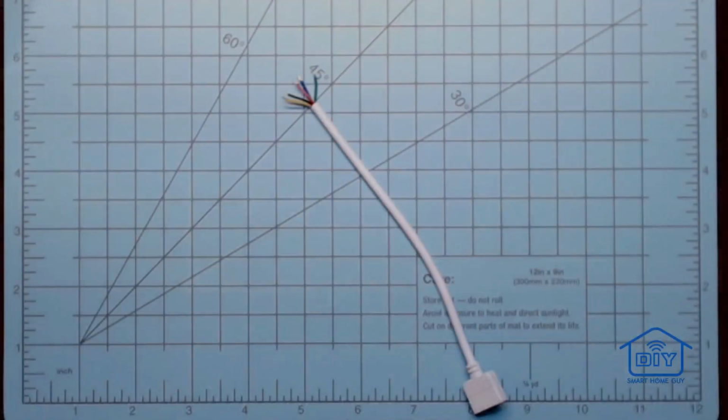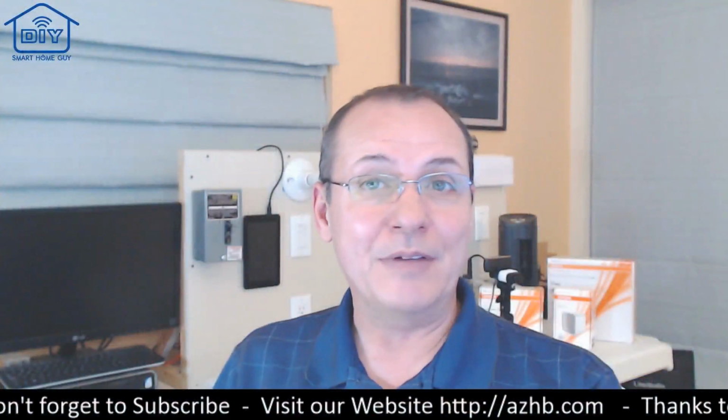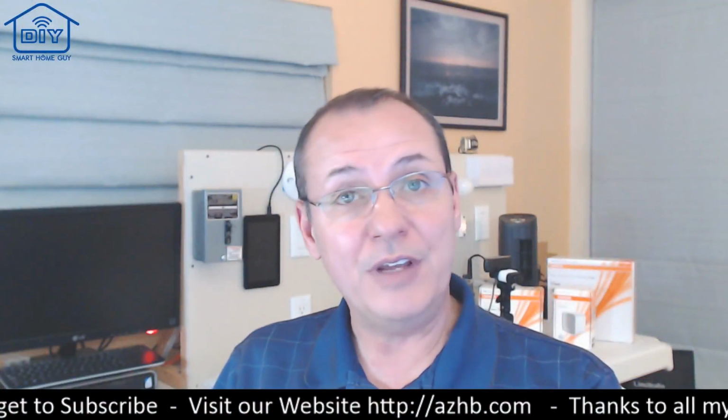This is where this little beauty comes in handy if you have DIY soldering skills. You can put two of these together and reverse the white and blue wires, and voila, the problem's solved. The only thing you need to worry about now is that you don't go beyond 20 feet and that you're using 12-volt LED strips.